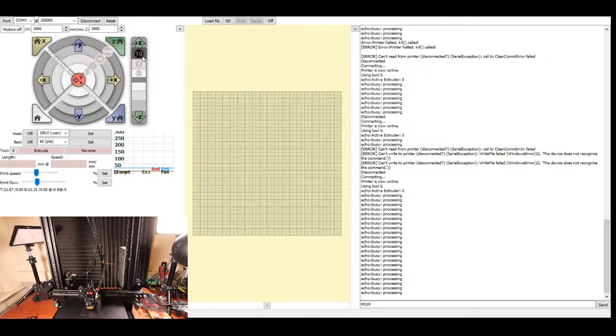So as you can see, it moves approximately 10, but if you haven't noticed, on the far left-hand side of the printer, there's little gold marks. That's one of my cheat sheet things that I do to actually check the steps. So as you can see right now, it's aligned with one of those gold steps on the far left side here. That's what I use to actually control the tuning of it.